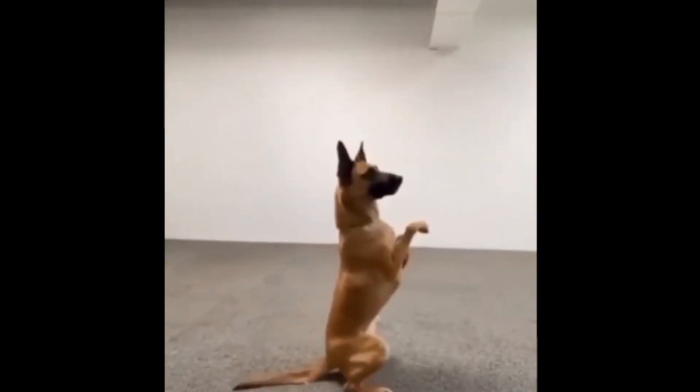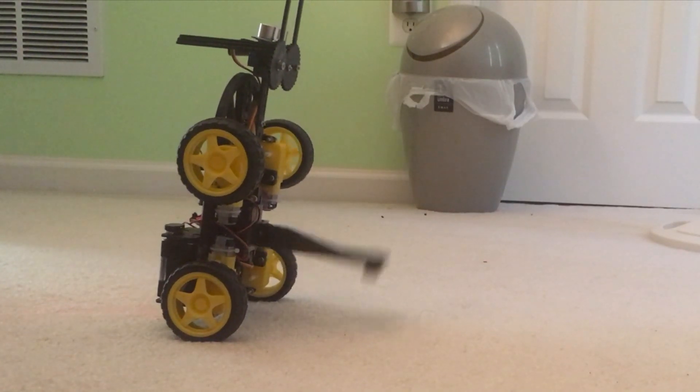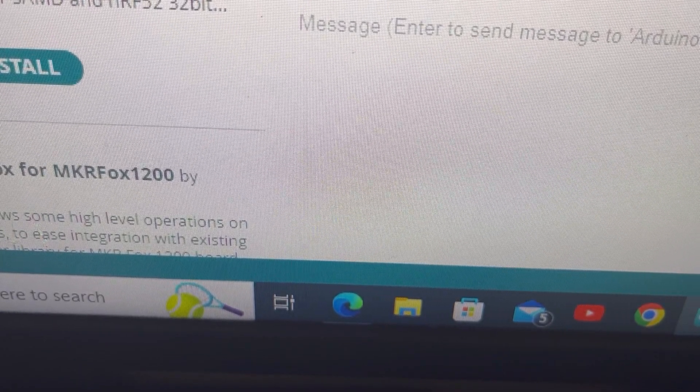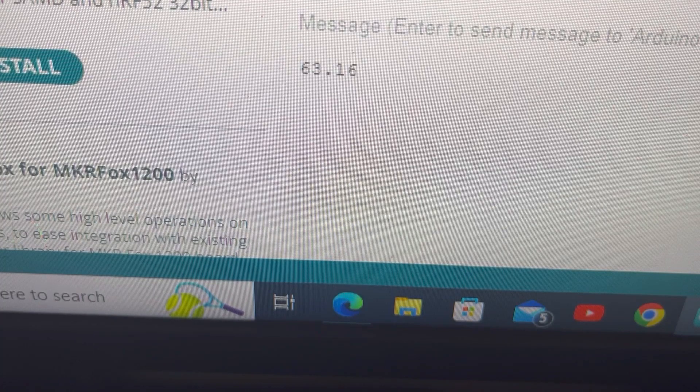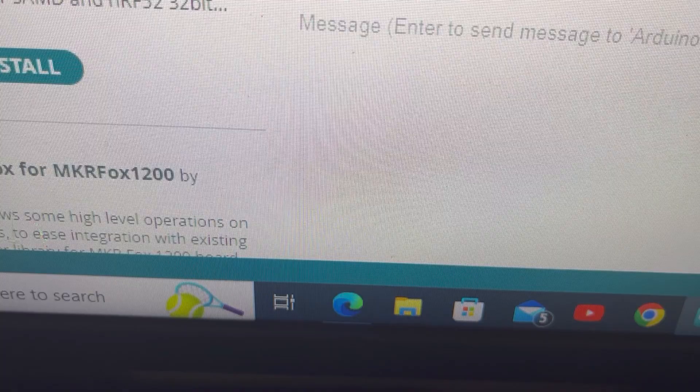Look at this dog — it jumps up to balance, which is pretty cool. Now look at the Robodog: it slowly inches up and then balances. Pretty slowly and pretty boring, to be honest. So let's make it jump and balance like a normal dog would. We can simply speed up the lift arm, which is pretty easy. But how will the Robodog know exactly what balance angle to aim for right after jumping? I simply ran the old balance routine and had the Robodog print the balance angle right before it was going to balance. I then saved that balance angle into the code so that the Robodog knows to aim for that exact angle again after jumping.